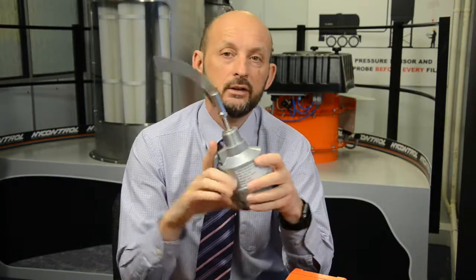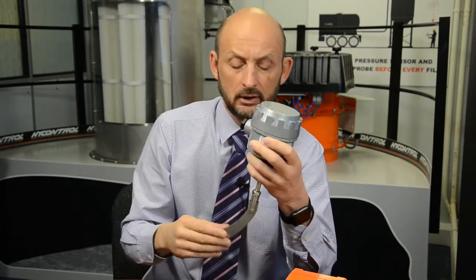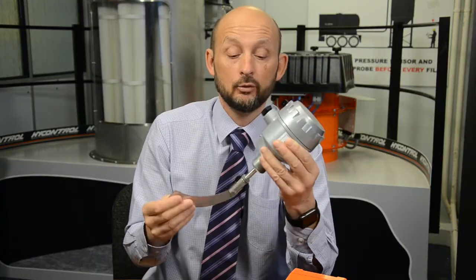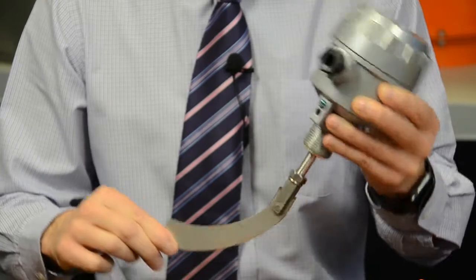For a typical application like cement, what's the most popular device? We could use a paddle switch — these are abundant in the cement industry predominantly because they are the cheapest device available. However, there are drawbacks: a motor rotates the paddle and can wear out, the blade can wear out, and seals within the shaft need changing. If the blade were to drop off, there is no mechanism to detect that. These products range from $200 to $800, and as they rotate into a light product they can dig a hole, becoming less sensitive.